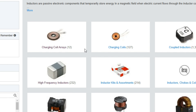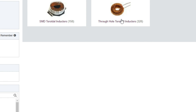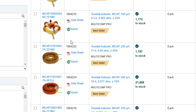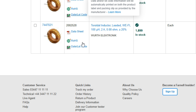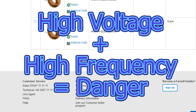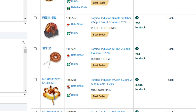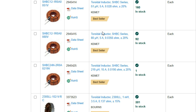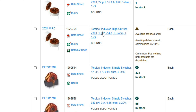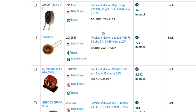What I'm looking at here are all inductors or coils. That's a fairly obvious looking toroidal coil, and you can see there are hundreds of them. When you see a coil like this with thick wire and sticky-out bits, regard it as something worth being very careful about, because invariably they will be used for high voltages and/or high currents - in switchmode power supplies, or depending on physical size, in RF circuitry. Microwave ovens are RF circuitry and have things like this in them, so be careful.